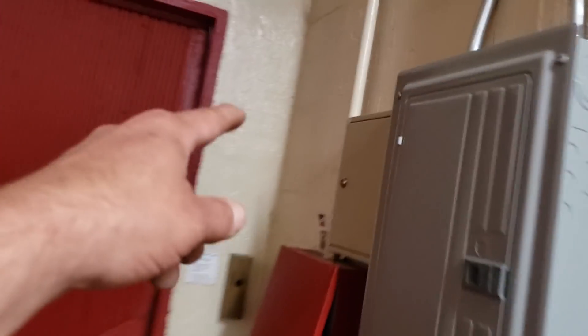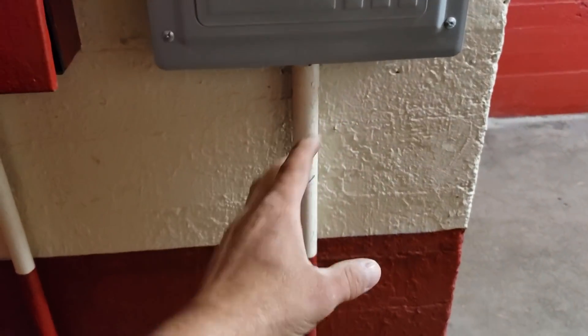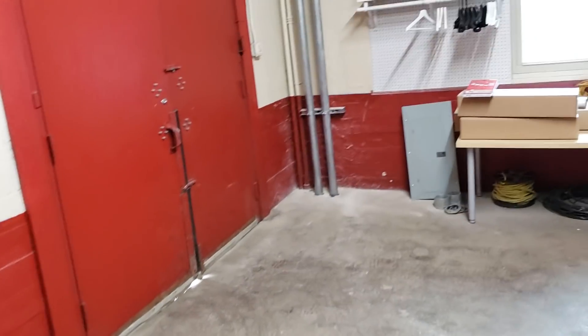They have another panel over here, so I'll feed that panel out of my new distribution downstairs. I already have a pipe running all the way over to it — that's what's feeding it right now. I'll cut it off, refeed it, and it becomes a sub-panel. Then I can get rid of the old feeds and cut those out. Same kind of thing on the second floor.